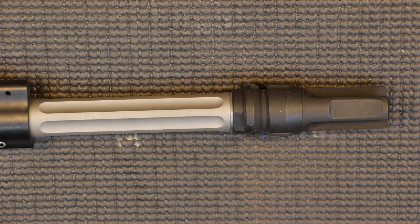Let's talk about the weight of the barrel. According to Ballistic Advantage, this barrel stripped down — without the accessories I've added — weighs in at 25.8 ounces. Obviously, I had to add on the pin-and-welded muzzle device, the low-profile gas block, and the barrel nut to get it installed. However, the weight according to my scale now comes in at about 33 ounces. I've gone ahead and pre-assembled the rifle, and I can tell you the overall weight, even including these accessories, is still a fairly lightweight barrel — and it feels great in the hand in terms of balance.